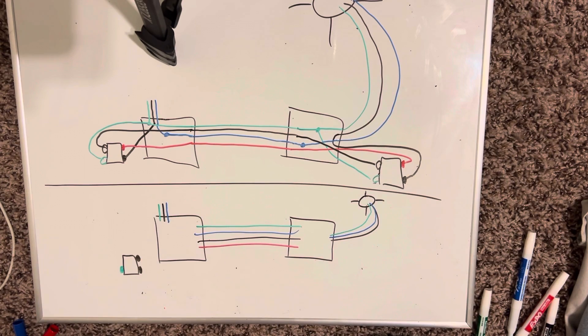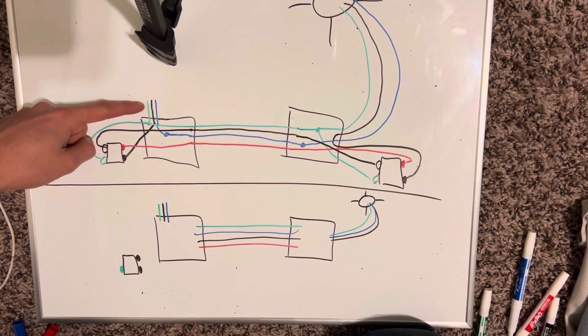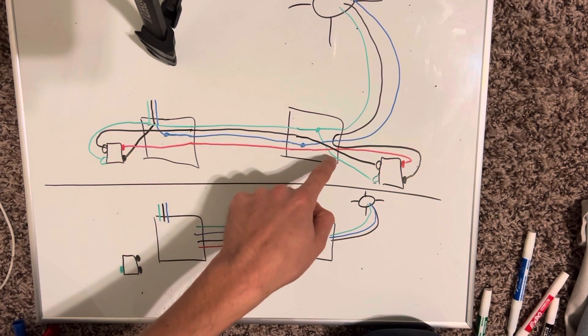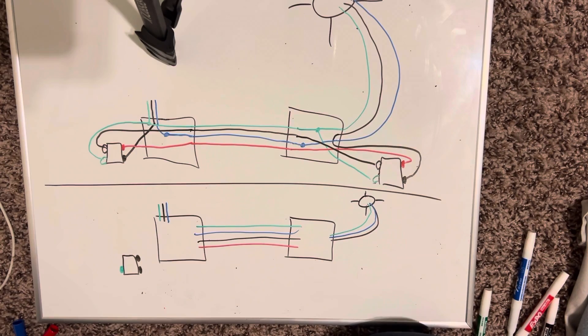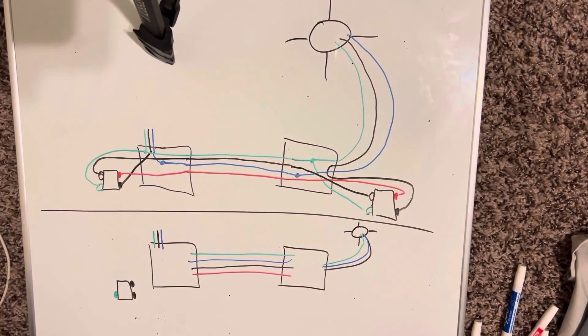Anyways, I think I'm going to his house on Friday, but I just want to give you guys a prep video explaining how to turn a three-way switch into a single pole switch. I drew out right here your normal three-way switch — just power coming in, one three-wire going between boxes, and then a single two-wire up to a light.